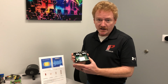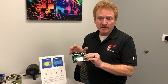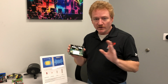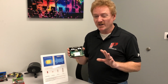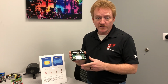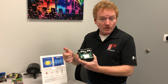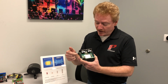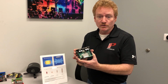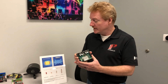It's really fast. In addition to that, this servo driver also samples all of the power supplies and the temperature of the board, and can also sample an external temperature. All of these samplings are done at much lower rates, like 10 times per second, because these other quantities are not so important. But this is a very versatile servo driver, fully digital. You drive it with a digital command signal, and there's also the ability to have TTL inputs and outputs so that the board can both be controlled by and also control external things.